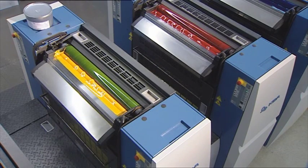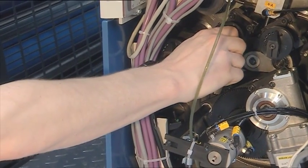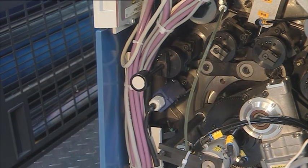The fast-reacting, single-train inking unit of the Rapida 75E excels with very high repeat accuracy and stable ink metering. Oscillation of the ink form rollers can be activated at the printing unit as a further guarantee for a constant, ghosting-free print result.